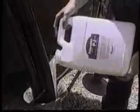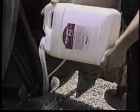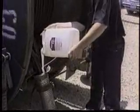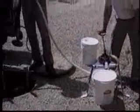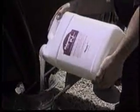The second form of Polywater J is the pourable lubricant called PJ. For underground pulling with feeder tubes or conduit stub ups, a pourable lubricant is neat and practical. PJ is packaged for pouring in one and two and a half gallon jugs with handles, and a five gallon pail with a wide pour spout. PJ lubricant is being poured from a two and a half gallon jug onto cables during a pull. The liquid PJ is easy to pump — the LP3 pump shown pumps on both the upstroke and downstroke. The output hose length can be customized to meet special application needs. The LP3 pump is rust resistant for compatibility with water-based lubricants. For underground work, Polywater PJ eliminates the need to hand apply lubricant. Pouring is a fast and clean way to lubricate.